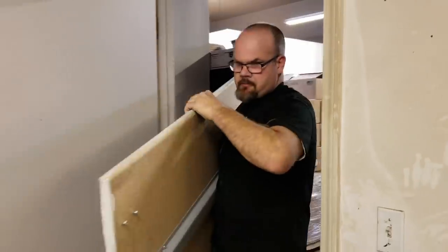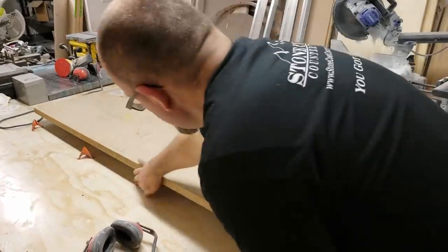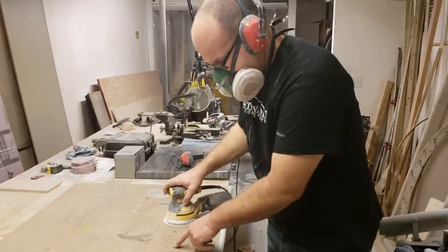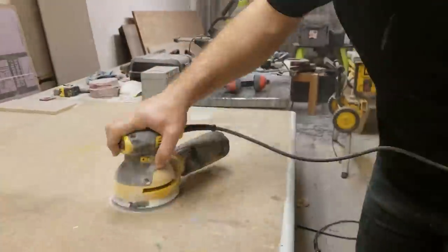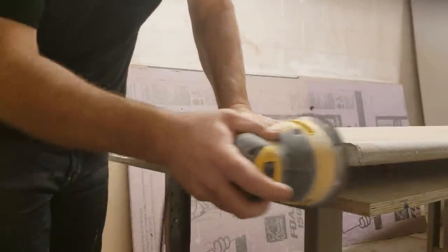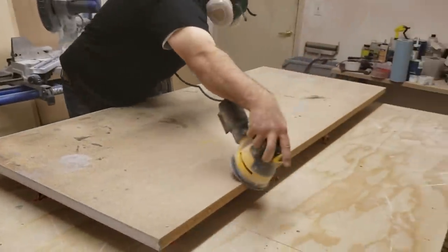We've got these workbenches off of Amazon. We'll put a link in the description below. We have a ton of them — we love them. They're sturdy as an ox. We'll sand this flush, remove any epoxy drips and high points, and then we'll finish this surface with 220 grit on a random orbital sander. We're going to sand the surface as well as those edges and be sure to knock down any 90-degree angles so you get a better roll on that epoxy and a better finish.